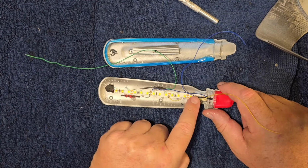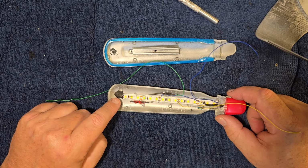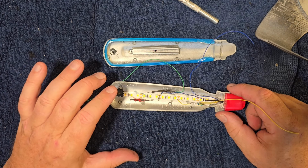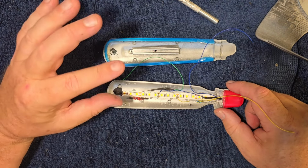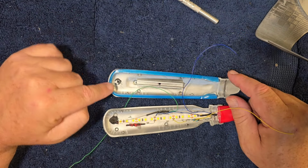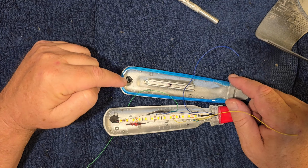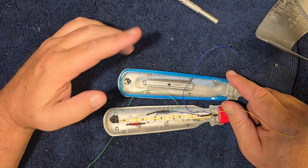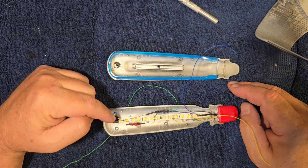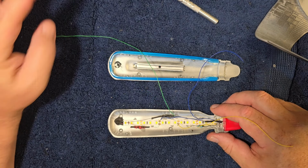All right, so we have these nacelles there. Now, right here is an 0805 white SMD, and we're going to connect this to the strobe effect from the nav board. So it's going to be the fast blinking one. Now, you may see there's some black bits there. I had another one there, at the bottom of the nacelle. I had another 0805 there, and I had wired it up and everything. And then I realized I'm going to have to wire that over here and connect the special negative wire for the nav board that it connects to, because these things,